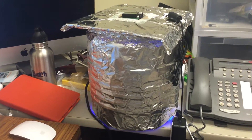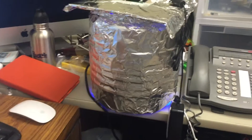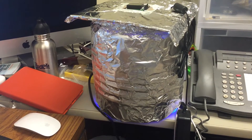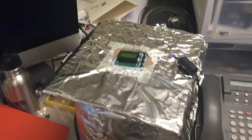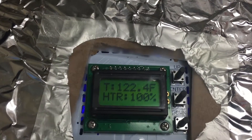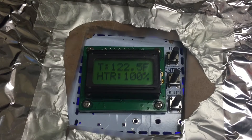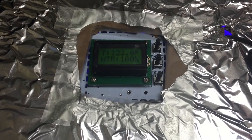Here is the first iteration of the SLA 3D printer's post-curing unit. What I have here is a large glass jar with a 405 nanometer LED light strip encircling it, and instead of the glass top for the jar I have just a cardboard lid with an egg incubator. It's set for about 150 Fahrenheit but is only able to get up to somewhere between 122 and 125 Fahrenheit, so that's a little over 50 degrees Celsius.